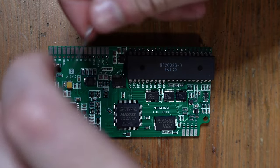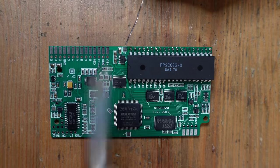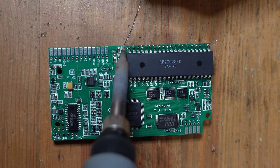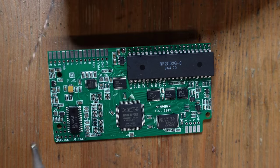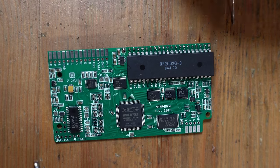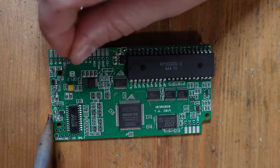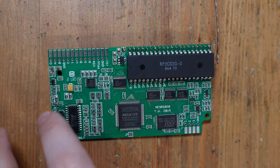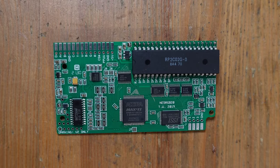The last two things we need to do to the board itself are solder in two jumpers. Jumper J3 needs to be closed — this is for power, so we're using power from the NES itself. They send you an adapter board for power but I've never found use for it and others have shown it's unnecessary. We're also going to close jumper J5 because this is a North American NTSC console — for Japanese and North American consoles you close this jumper. For European consoles, you leave it open. Now let's start wiring in the audio.